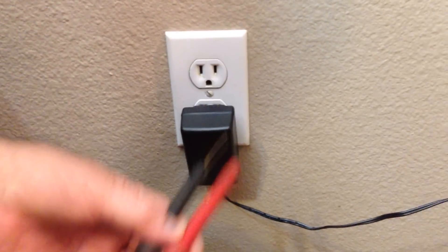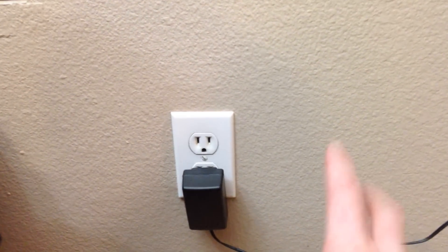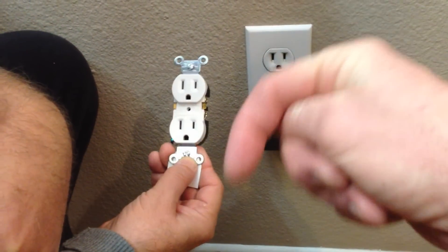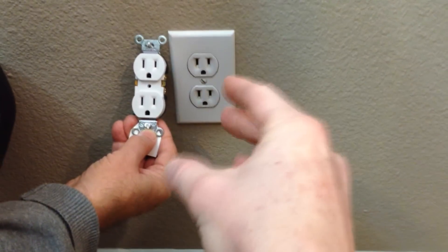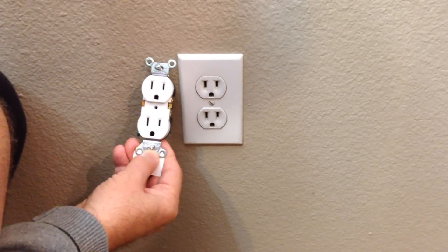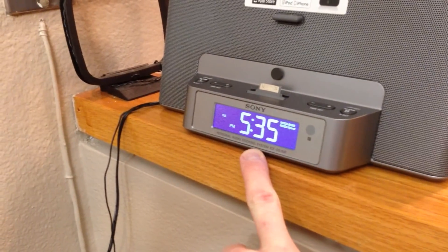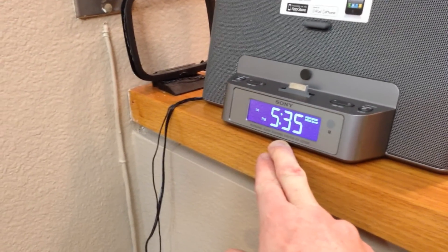The first thing we're going to do to switch this out is shut off the breaker to the electrical socket, so there's no more power coming into it because we don't want to get electrocuted. Here is our new one we picked up — all the links are in the description box for these new products. How to turn off the breaker: you probably want to plug your tester machine back in or have a light plugged into it so that if you're home alone, you can turn off the breaker and when the light goes off, that means the socket no longer has power.